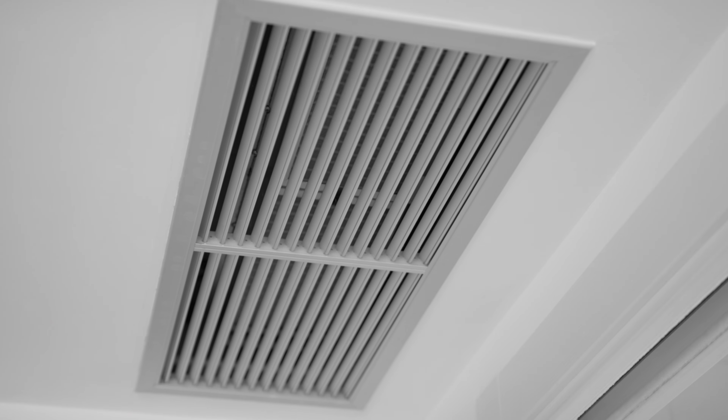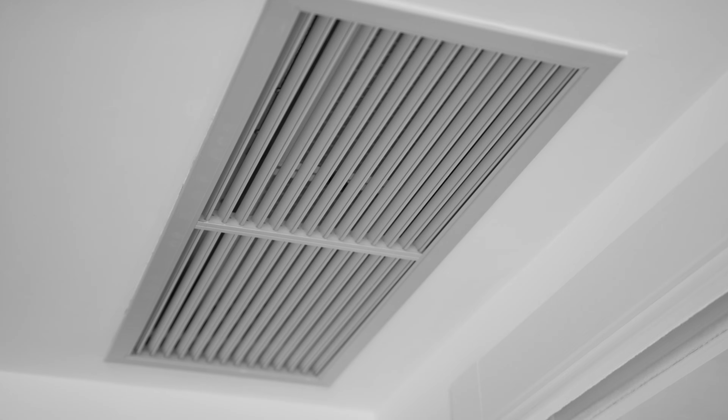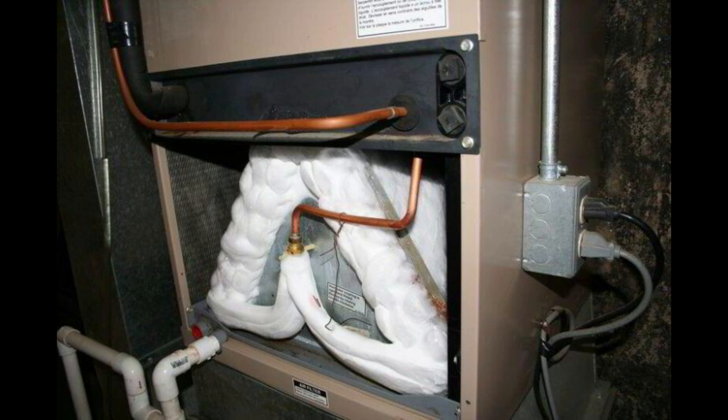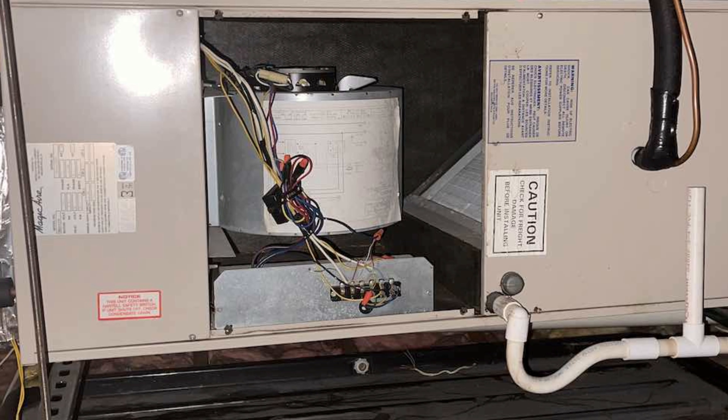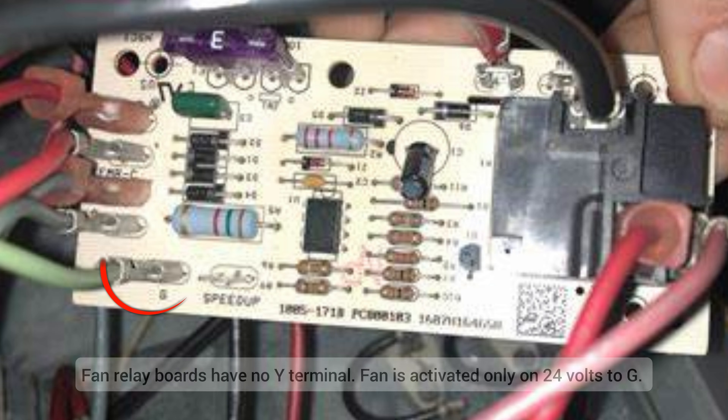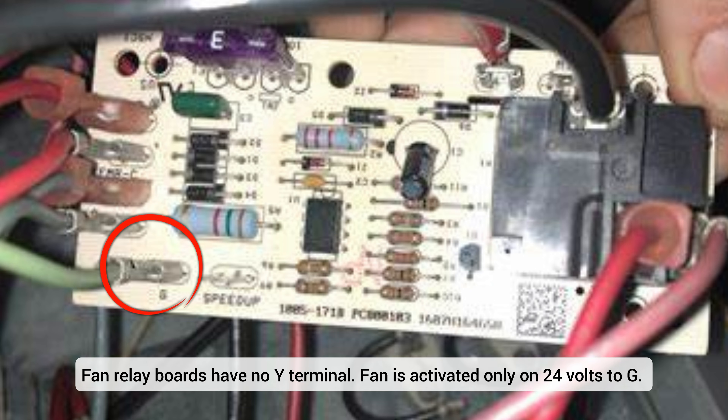You don't want to check airflow by getting lazy and putting your hand up near the vents, because if your evaporator coil is completely frozen over you're not going to feel any airflow. You actually want to go to the blower itself and make sure it's spinning. If your blower is not turning on, one possible reason is the thermostat itself. While you're at the air handler, test the Y terminals and G terminals — make sure you're getting 24 volts on both. Some systems activate the blower on the Y signal, some do it just on G, so testing both covers you. If you're lacking voltage on either, the problem most likely is the thermostat.